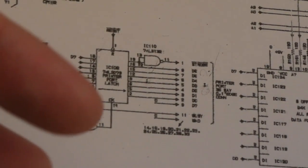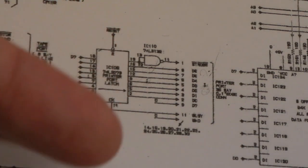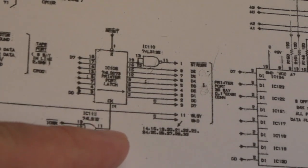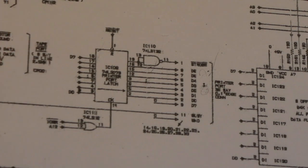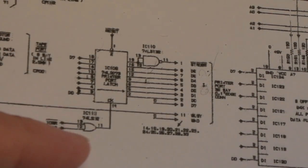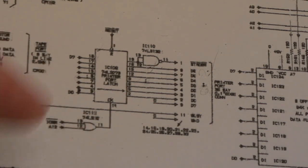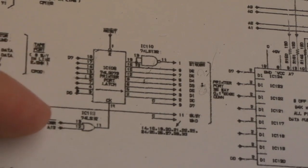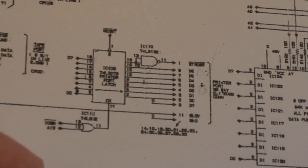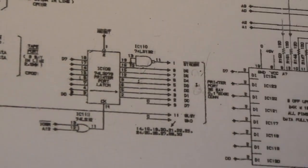If the two signals were out of sync with each other, alternating, inversions of each other, as they invert, you would have a high here, so you would always see a high. So, yeah, it can make diagnosing things like that a little bit difficult, but that's unlikely. You generally wouldn't get that kind of scenario. But you can still apply the general logic that it's an OR gate, one or the other being a high input for any period of time should give you a high on the output. Anyway, that was floating, our output.